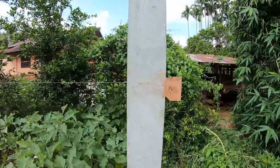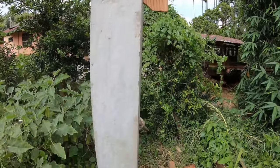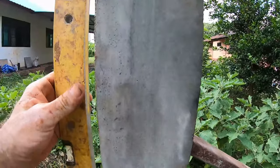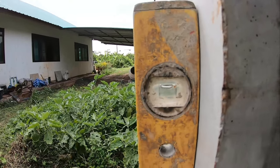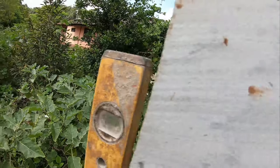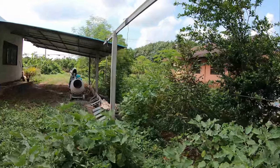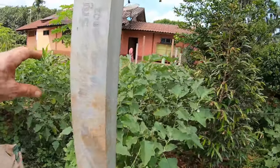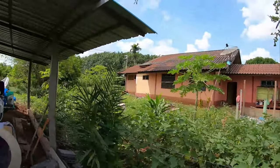Well I've levelled it through. You can see that — it's a bit of fishing line. That's as good as damn it. You won't get it a lot better than that. You can see the fishing line going through here — must be about two millimeters difference there, but I'm not concerned about two millimeters over such a long stretch.